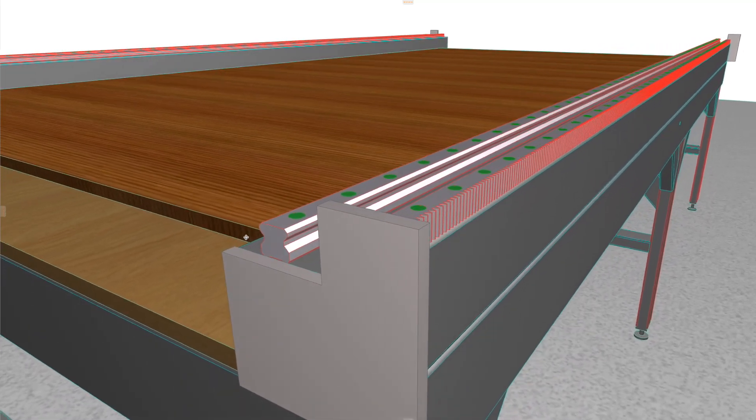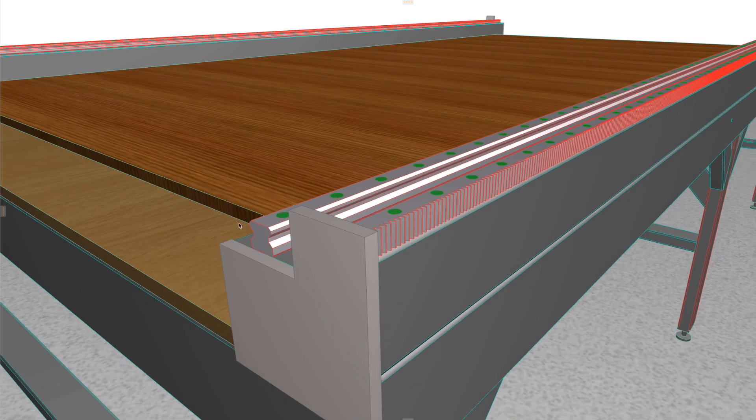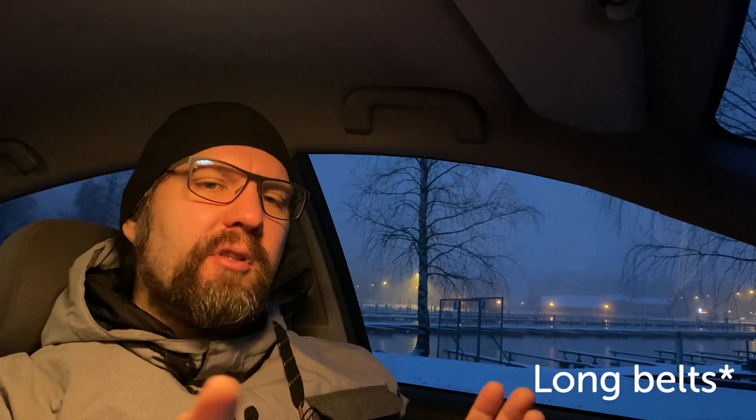The next video is going to cover just that CNC router, so make sure you subscribe. The biggest change since the first plan — after doing some research — was to ditch the belt drives. The Y-axis, which is the longer axis, is now going to be driven with rack and pinion. The X-axis, which is the shorter axis, is going to be operated by ball screw. The reason for this change is that belt drives can be a little problematic — the belts tend to have some backlash issues and also stretch just a bit over the years.